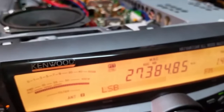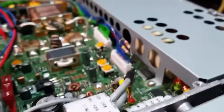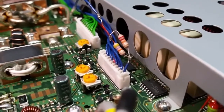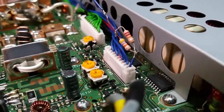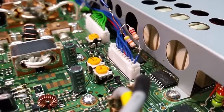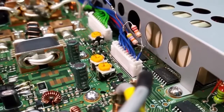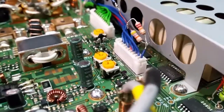I've been sitting here pounding on this thing for about an hour and a half after doing this resistor mod, and this chassis runs nice and cool. She's not drawing an excessive amount of current. Don't go saying 'oh, you can blow your radio up, blah blah blah' — I don't want to hear it. This modification is for people that either can't get their computer or their radio to connect to the computer, or if they're just too leery of it and don't want to risk bricking it. This is your best bet — that is your HF ALC line.